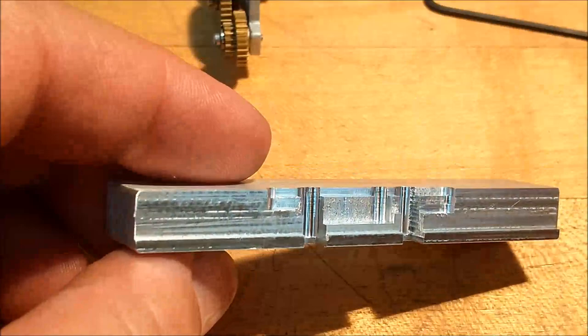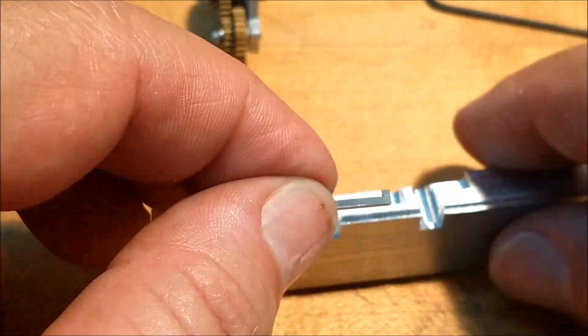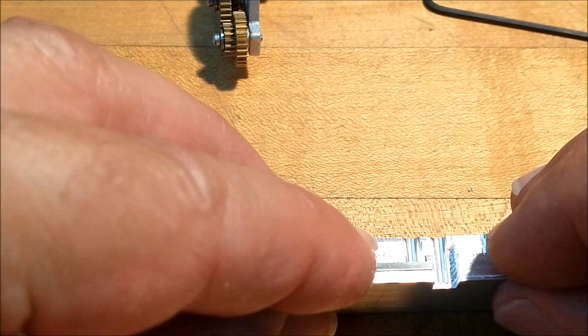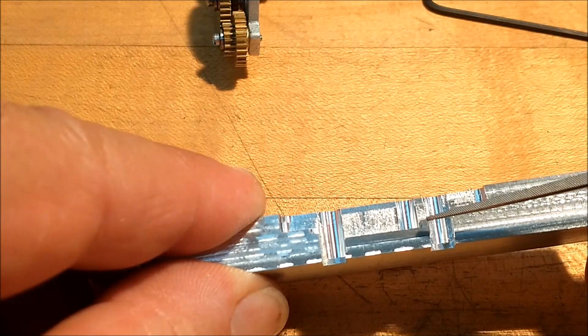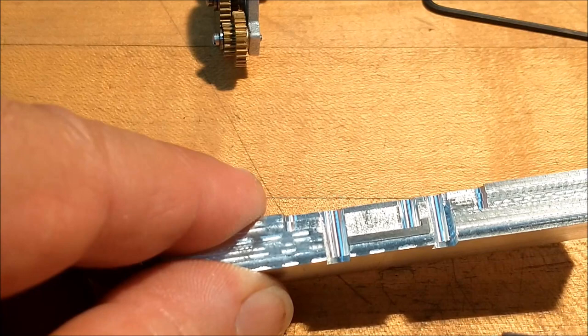Here is the fixture that I used to do that little keyway, and you can see the final remnant of the part right there, that little L shape. That is this guy. That was completely blind. I trusted the numbers on the dials and had to make only one adjustment. That was the thickness of this end right here, because that's an 062 wide tab going through an 062 diameter hole, and that's just never going to happen. So I put on a sander and bump the end.